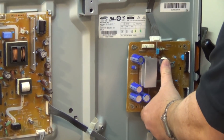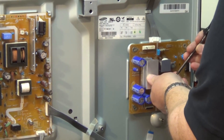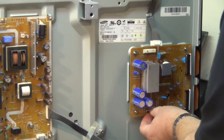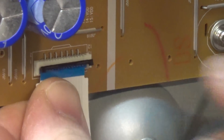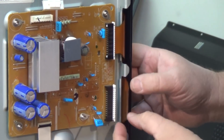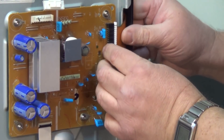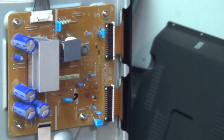When you mount the board back in, be sure you tighten these ground screws down good, because that's what initially caused this in the first place — heating and cooling through thermal expansion of dissimilar metals caused the screws to work their way loose and start to arc, which caused the ultimate failure of these components. Next we'll insert the FPC from the logic board into CN4004 and close the gate on the connector. Next are the common sustained electrode connectors — the solid copper flexible edge connectors that connect to the panel — to provide the sustained drive from the X main board. Finally the power connector to connect power to the power supply via the Y main board.